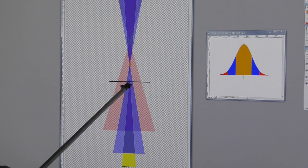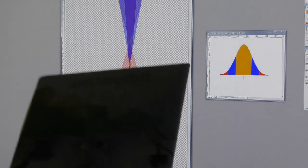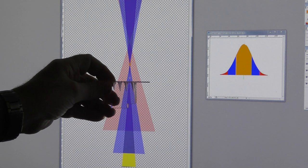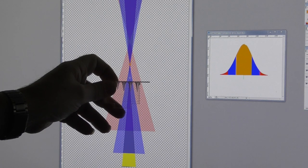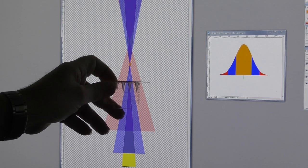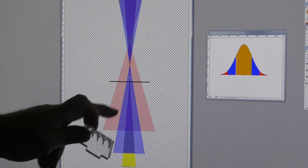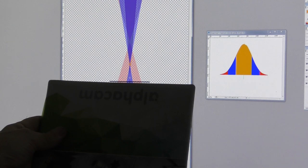Okay, but you mustn't imagine that these rays are actually decreasing in intensity. They are not, because they're only having an effect at this point here. On their own, they will produce a pointed burn, which has got nothing to do with focus. So this is very misleading. At the point of entry, we will get an intensity distribution, and that intensity distribution will produce a point, which has got nothing to do with focus at all. So this diverging beam just doesn't exist. It's just the intensity of the rays at the entry point, which is important.